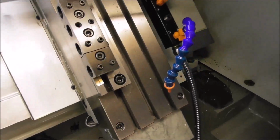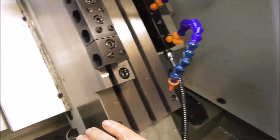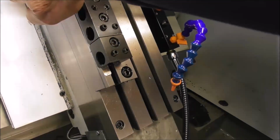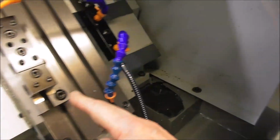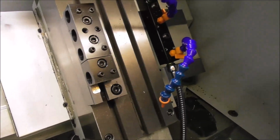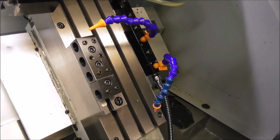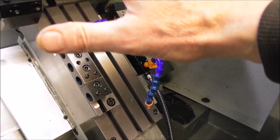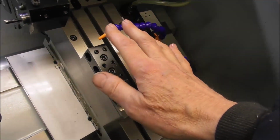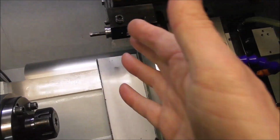And if you look at the X slideway with that ratio point in mind, you can see it's very long compared with quite a narrow width. The ratio is much more in your favor between the length and the width of the slideway. Now that means that the chances of it racking and the high pressure point wear is going to be much less. Also the weight is less, and so I'd be a lot less worried about the X slideway on this machine, 10 times more worried about the Z longitudinal slideway.